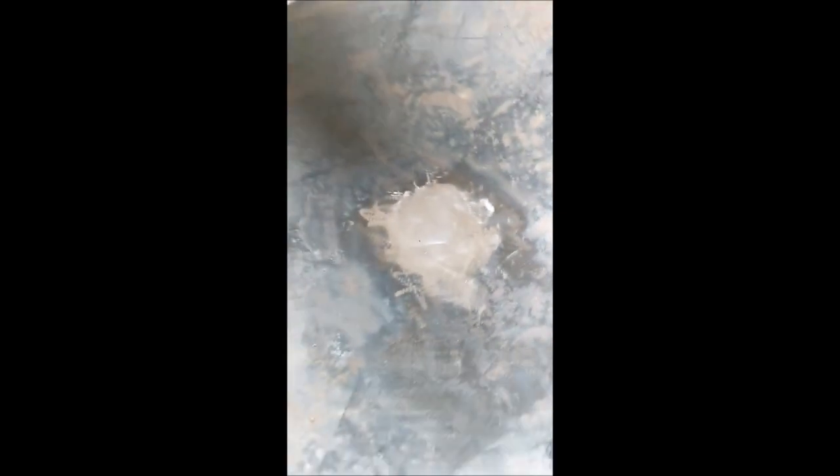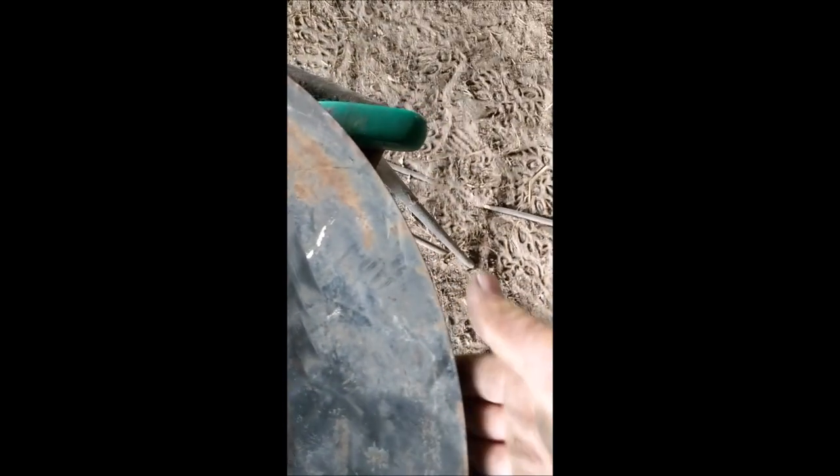As you can see, I've got it welded up and ground down on both sides. I used some washers and got that all welded up and ground down. Now we've got to get the rest of the paint off, and then we need to put some handles on it. I tried using a flapper disc but it doesn't seem to want to take that paint — it's kind of baked on. I may just have to throw this in a fire, let it burn all that off, and then finish it and figure out some handles from the scrap bin.